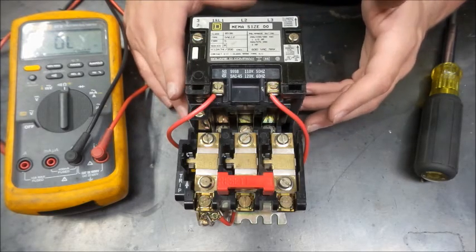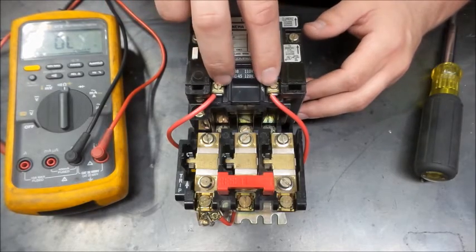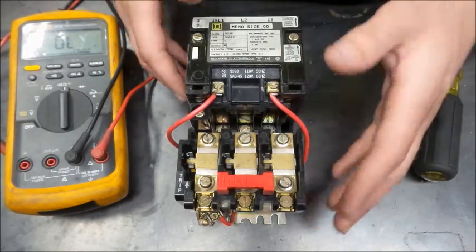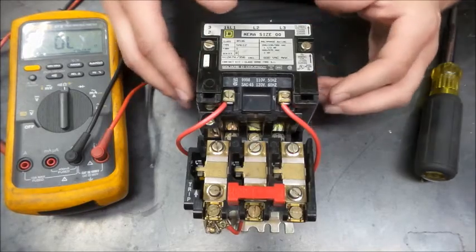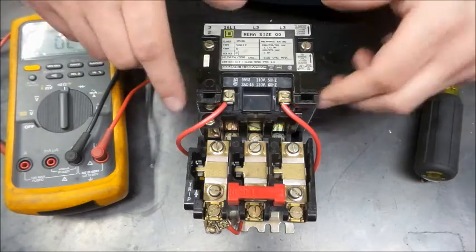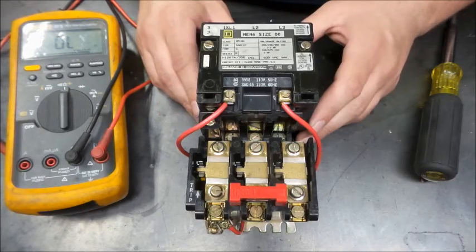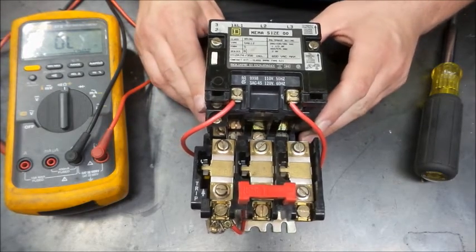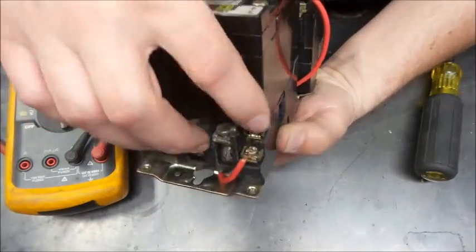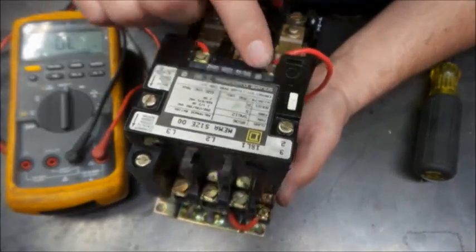This is a simple contactor style, 2 wires, 120 volt coil, so we put 120 volt across this. The contactor itself, the electromagnet in here, will close, and that means that it is one action just down, and there are 3 poles. So it's a single throw triple pole contactor, and this particular one does have an auxiliary contact on it, and that's where they have their relay coil wire going to.